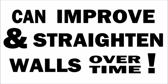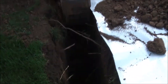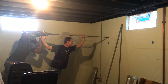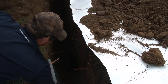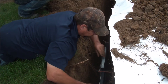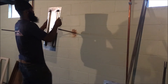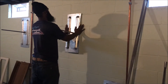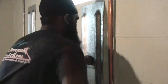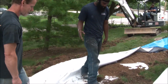The installation is simple. It begins by digging a narrow trench, maybe about a foot in width, parallel to the affected wall. On the inside, we drill a hole in the wall through which we can advance the steel rods until they meet the trench. The Geolock earth anchors are fastened on the exterior end of the rods, while on the interior, the hole is properly sealed and the steel wall plate is installed. The whole system then gets properly tightened and cleanup begins. The trench is filled back in and compacted, with grass remnants being placed on top, leaving the yard minimally disrupted.